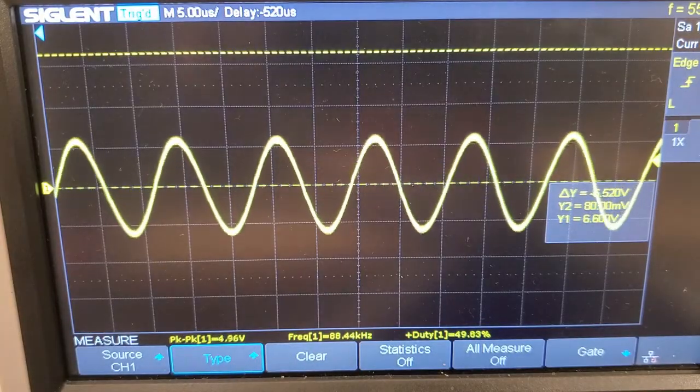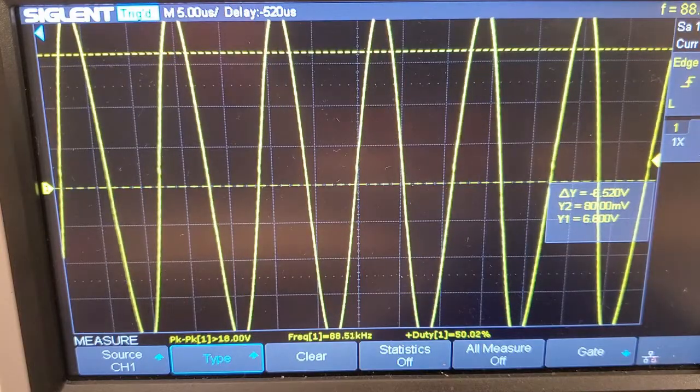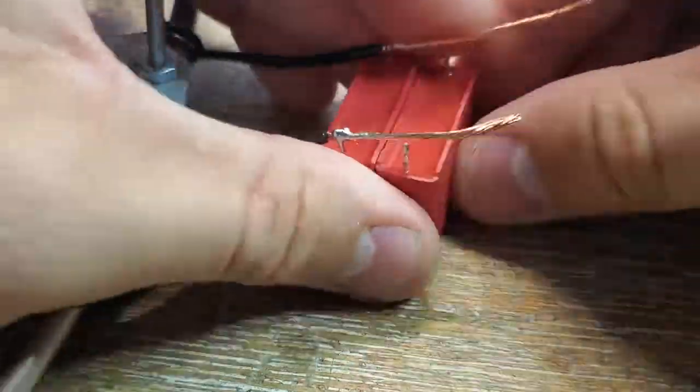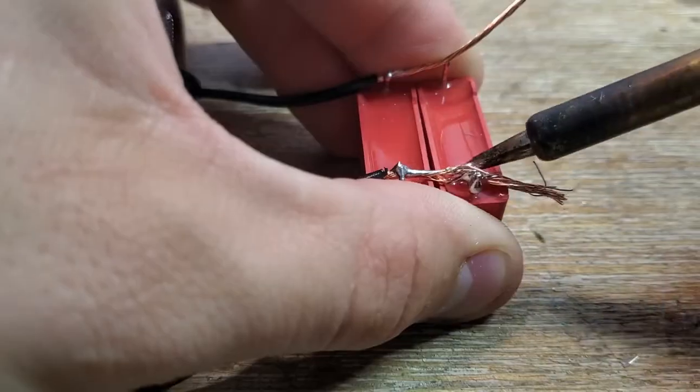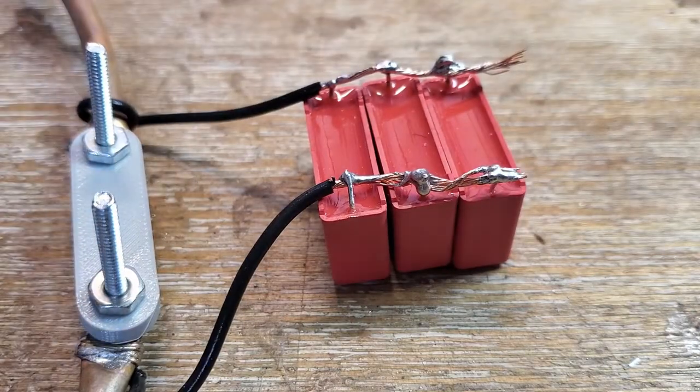Here's a closer look at the receiver voltage. The farthest away I'm getting is about 4 feet, and the closest is about 6 inches. To make the receiver work even better, I added some capacitors in parallel to make it resonate. The receiver loop is identical to the transmitter loop, so the receiver capacitance is also 3 microfarads.